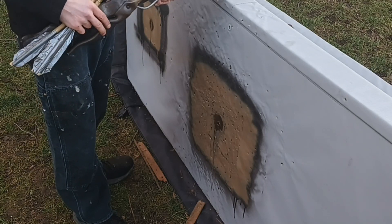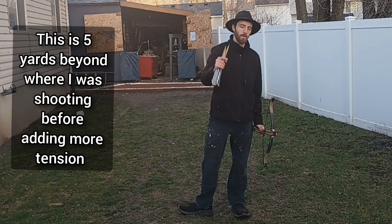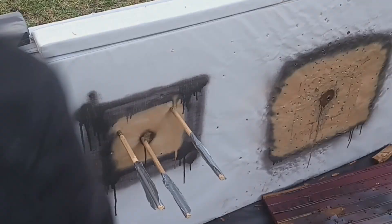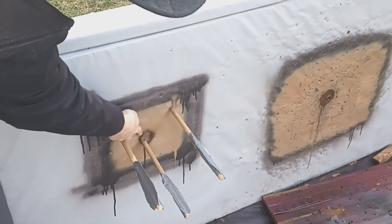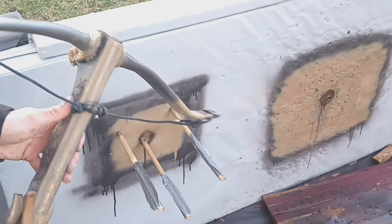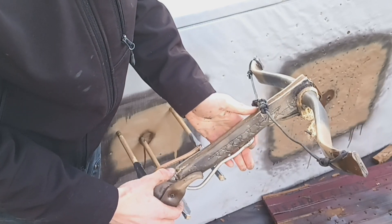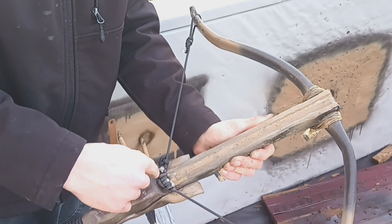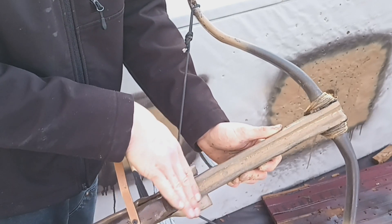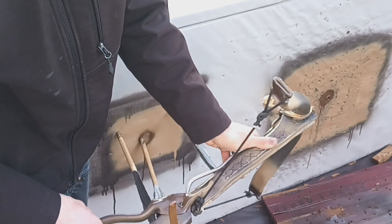And that's probably to do with the trigger mechanism. I'm going to show you guys what it's like for this to be firing towards you so you can see the flight of the projectile. This is our grouping — they're sticking in really good. I actually got a bullseye with it, that's really freaking cool. The trigger definitely aids in accuracy on this. You'll notice this knuckle kind of tapers back a little bit and it's flat on the top — what that lets me do is roll the string over top of it so it's kind of rolled back into place. This trigger will ride it and as you can see it'll start to roll that string forward.